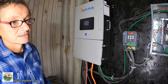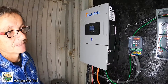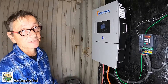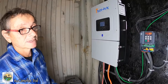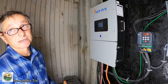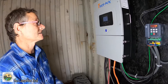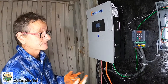Also, when you hook these up, three-phase motors can spin in either direction. If you hook it up and the amperage is extremely low, you know it's probably going backwards. If you're not getting any water and the amperage is really low, it's probably spinning backwards. And with well pumps, you can't spin them backwards for too long — you will actually spin the nuts that hold the impellers off. If you don't see anything coming out, think twice and switch the wire.